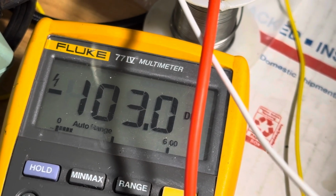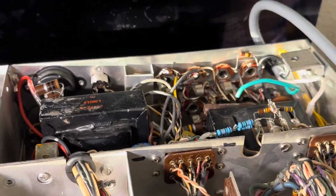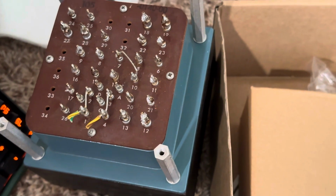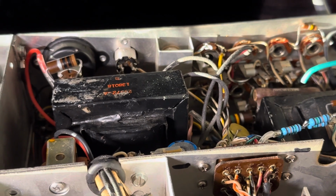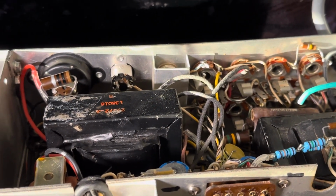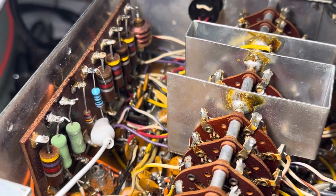But anyway, I have to work with what I have to work with. I tried changing the power supply today all around to even a different transformer, which I ran outside the unit. I was trying to get the Tektronix transformer to work. I had to series together 3 secondaries and get 600 volts out, but it was a disaster. So I just wired it up the way I had it, which is a 200V power supply configuration. Anyway, with that said, I just want to now get it to work.